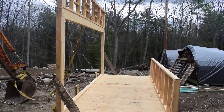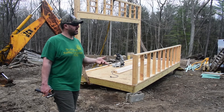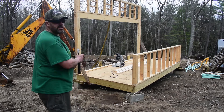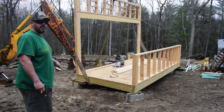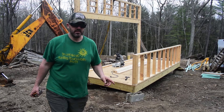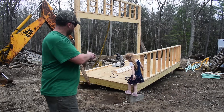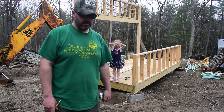Building the side walls means we get to start cutting some material. Before I can build the side walls, I have to cut all the dimensional lumber. I looked at the plans and got the measurements. One reason I put the front and rear wall on before building the side walls is so I'd have the exact dimension needed between them. I measured from here to here — my plans show 5 foot 11 inches, and right now I have 5 foot 11 and a quarter inches, about a quarter inch off. So I'm going to cut it to that distance so it fits nice and snug between the front and rear wall.